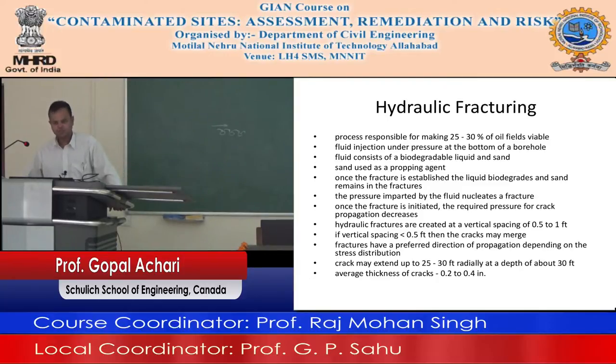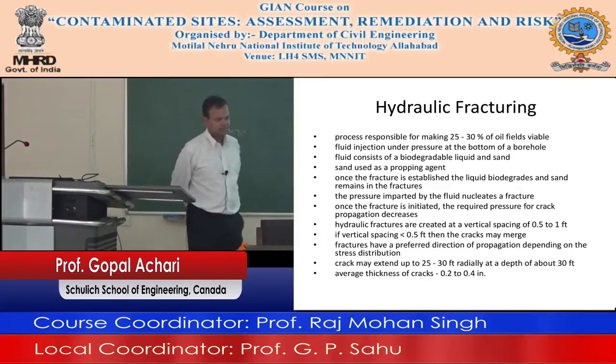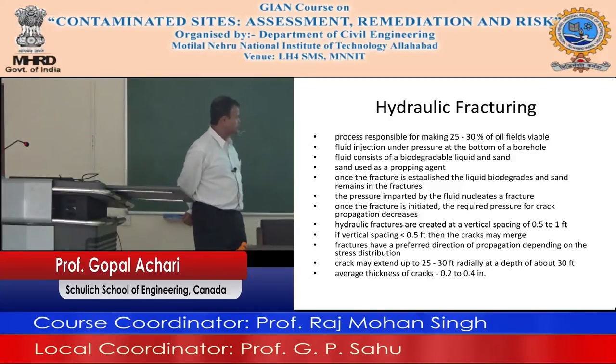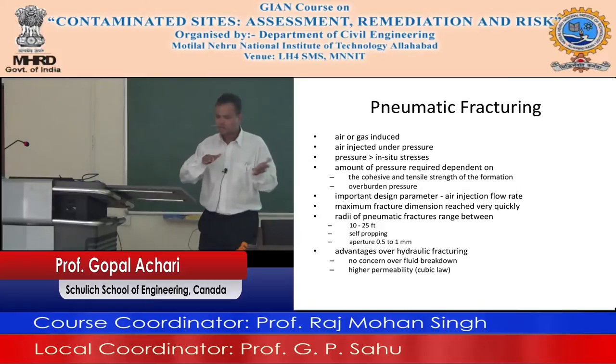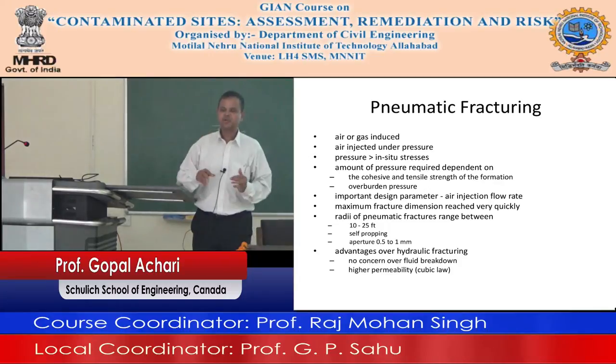It's self-propping, so no proppant is used, and the aperture is a lot smaller, 0.5 to 1 millimeter, as compared to 0.2 to 0.4 of an inch. An advantage of pneumatic fracking is you don't have to worry about the fluid breaking down as in hydraulic, and it also has a higher permeability, because think about water. If you're applying water, it will go into areas which are weak and open it up, but it's not going to go into all kinds of secondary planes of weakness.